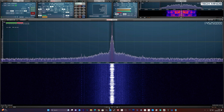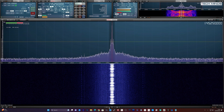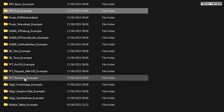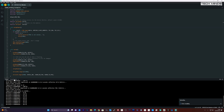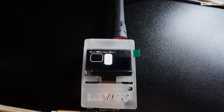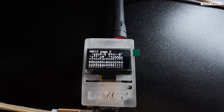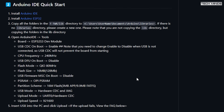The GitHub page contains a folder called examples, which allows you to download all of the examples and then try them for yourself. You can use the Arduino IDE to open these .ino files and then just download the firmware to the device. Just be careful to choose the correct board type, and under tools make sure the correct board settings are set. You can see which board settings need to be set on the front page of the TWR GitHub page.